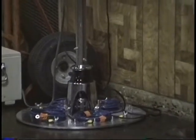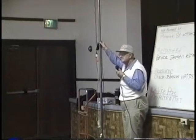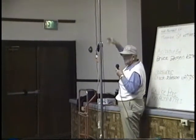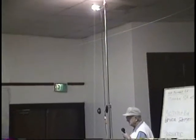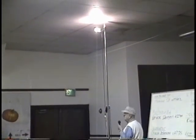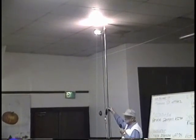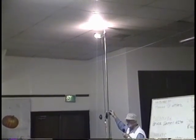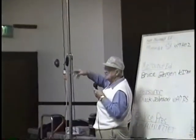The antenna has 10-foot black Dacron polyester guy lines. Each section has a knurled locking ring you can tighten by hand, backed by a jam nut, which is itself backed by another jam nut. Once you get it to the height you want, it will stay there securely.